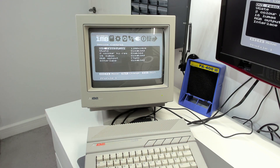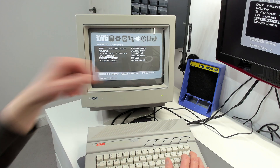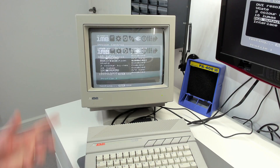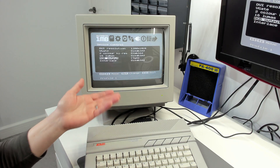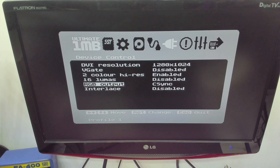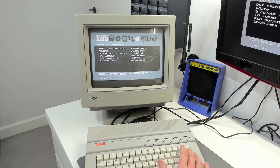So I was looking at the colour space setting in the Sophia 2 documentation. I'd already experimented with the RGB output setting in the plugin in the Ultimate One Megabyte firmware menu. I'd established that when I selected H-Sync V-Sync, we lost the picture, which is as you'd expect, because we're not using horizontal and vertical sync — we're using C-Sync because there's only one sync wire on the cable. This setting has more scope than just C-Sync; it's two different Sophia settings rolled into one.